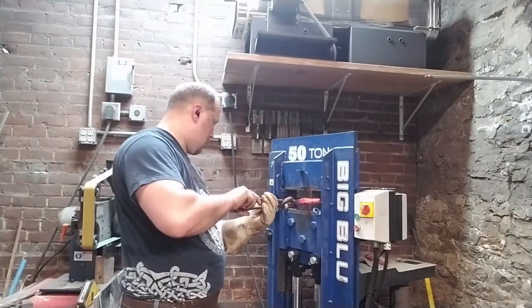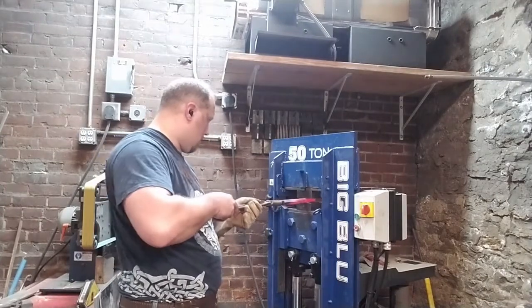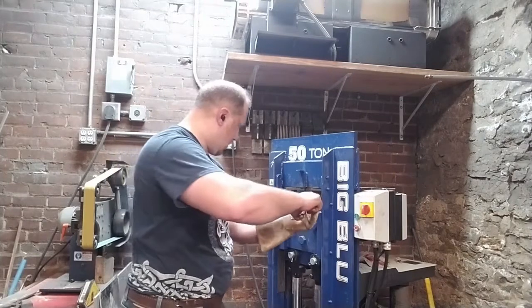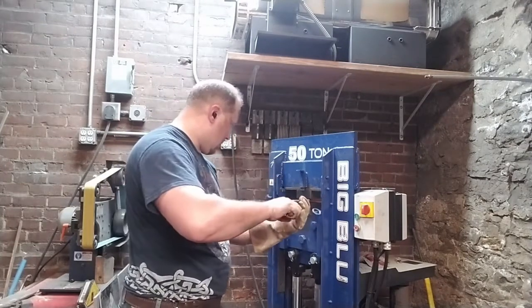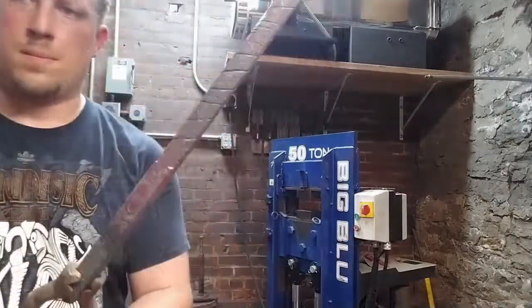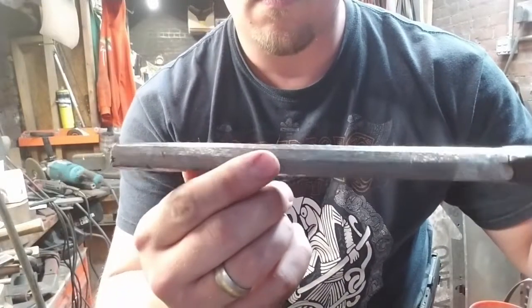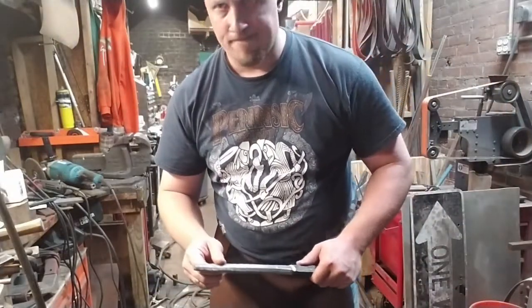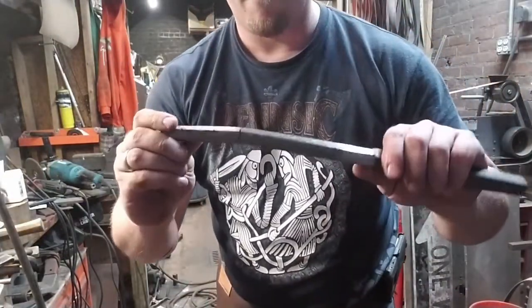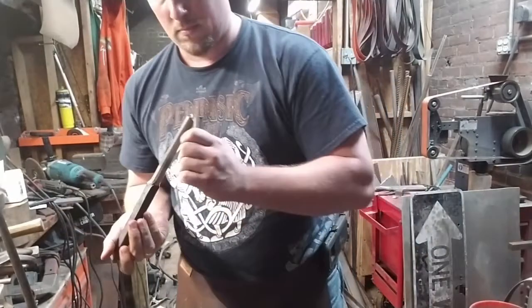As soon as you begin a twisting process, there will be points on your twist that will go faster and some will go slower. And if you want a nice even twist, it's very difficult to work out artfully. So if something starts to over twist, the best thing that you can do is stop. But I didn't stop fast enough, and I'm pointing out that even though we forged that out, there's still a crack there. Yep. And I'm just going to go ahead and break that off. And we'll grind it down and we'll work with what we have left.